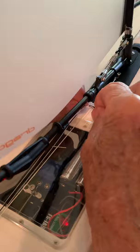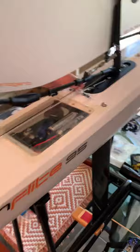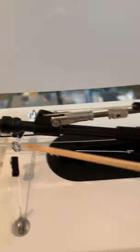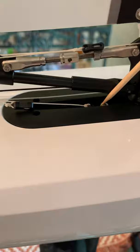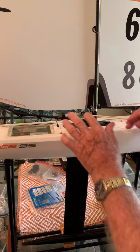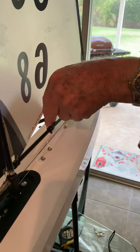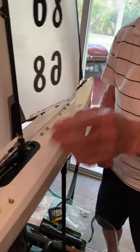Notice this jib sheet is going almost straight up now — that is another adjustment on the boat. These are very important things. Center this ring; it also has a tensioner here that goes back to your keel bolt underneath. Your kicking strap or boom vang is set up, your mainsail tension is about right — about a finger or two fingers. You've got the jib out about right — about perfect — with a little bit of slack.